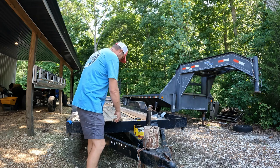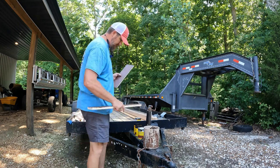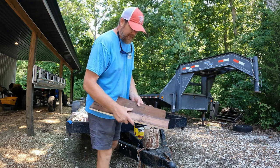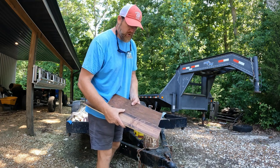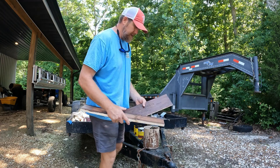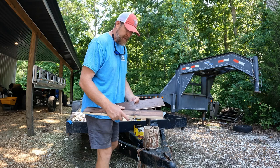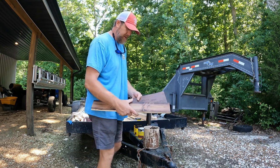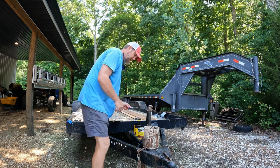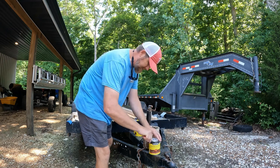We was doing a little experimenting with some stain colors. We're just gonna use the Minwax. But I think if we do two parts red mahogany with one part dark mahogany, I think we can get it kind of in that same tone. It's not going to be a perfect match, but this is going to be on the ceiling. This is on the floor. So as long as it's that kind of same tone, it's kind of what we're going for. I'll just put it in this bucket and mix it up.